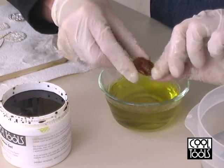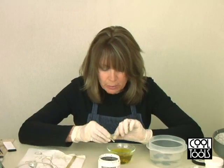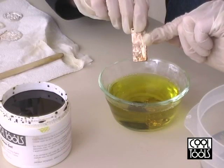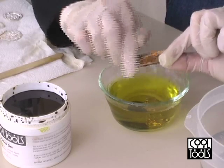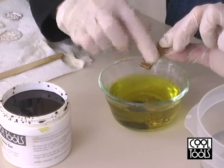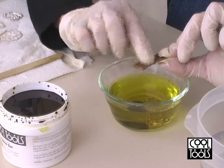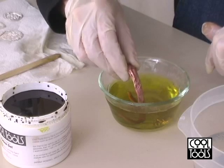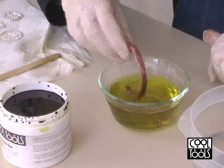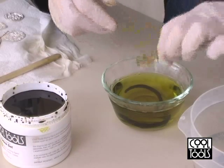This is really just to show you what's possible. This is a piece of bronze clay that's been polished — and you can see just where I'm touching it, it's instantly coloring. So that's the result you get on bronze. Sometimes I'll just paint it on and let that sit for a bit — that's kind of pretty. It also works on copper and it works real quick. I'll just dip my piece in and you can see that developing; I'm going to leave that sitting in there for a minute. I also have some brass here — this is a piece of raw brass and I'm just going to go ahead and dip that in.